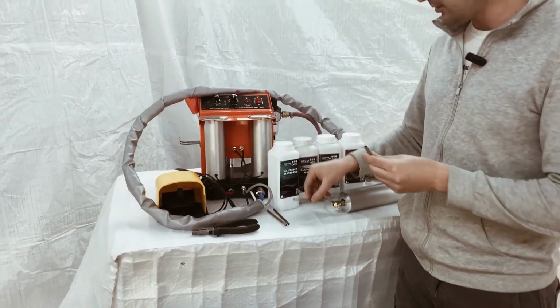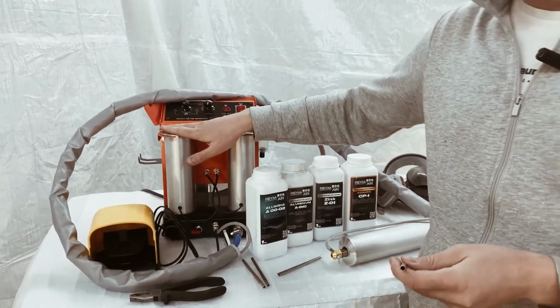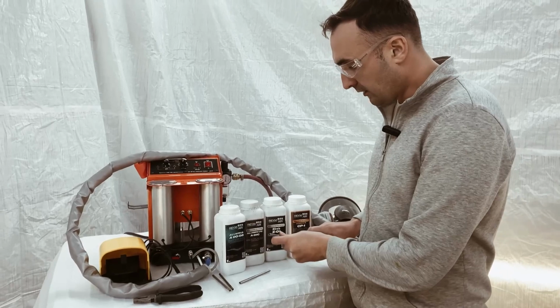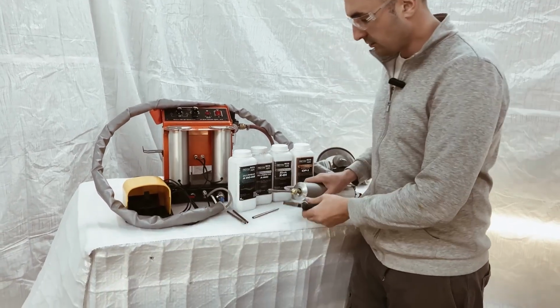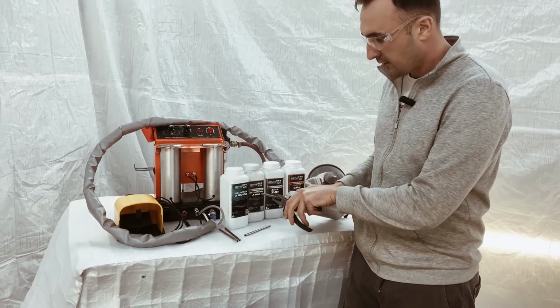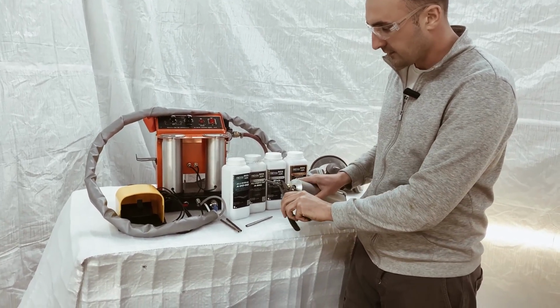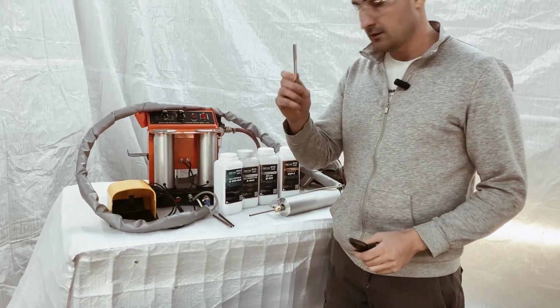Remember that at the end of each container, whether it is corundum or aluminum, when the powder runs out in the container, each time we rotate the tube by a few degrees. We loosen this valve, rotate it a few degrees, and then tighten the valve back. The same applies to this type of nozzle.